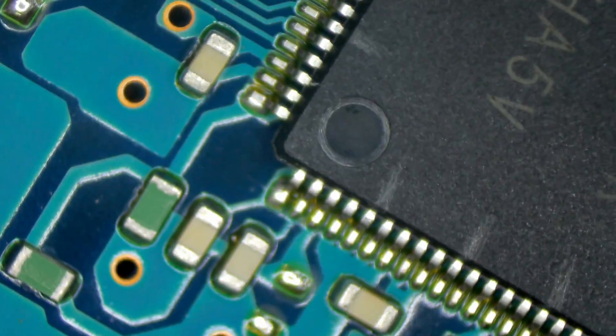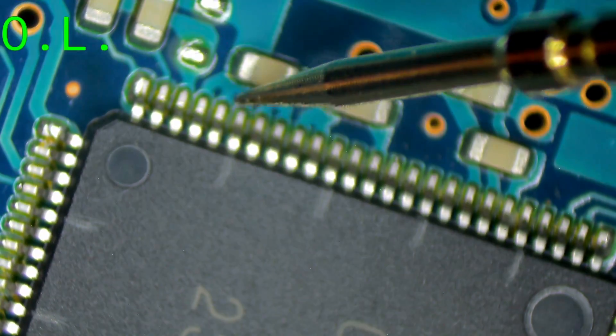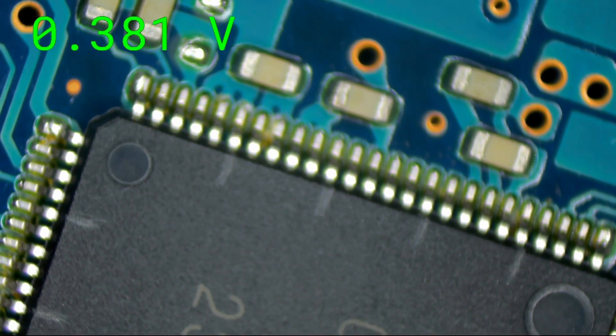Now the original thing that I had suggested be done here did not actually work. I originally just took a look around the board because I don't really have familiarity with this device — I have not used the PlayStation in 20 years, much less worked on one. What I was looking at was this chip over here that is right by the output. What I did is I suggested checking every single one of these pins against a working board in diode mode to ground, just to see if you get a different outcome. This is something I do when troubleshooting MacBooks: put the red probe on ground, go around to all the different pins, record the values in a spreadsheet, and compare to the dead board to see where there's a difference. And there was no difference in this area.